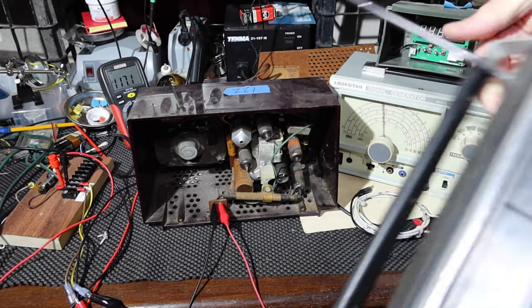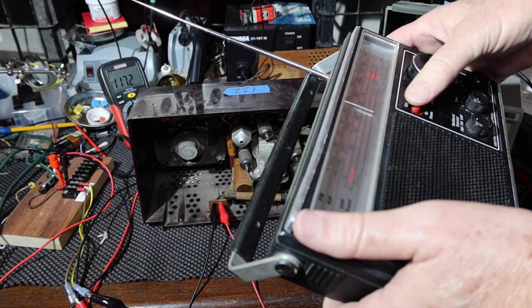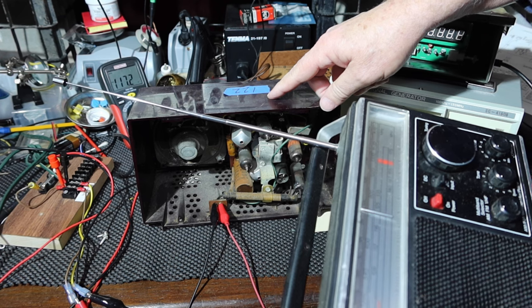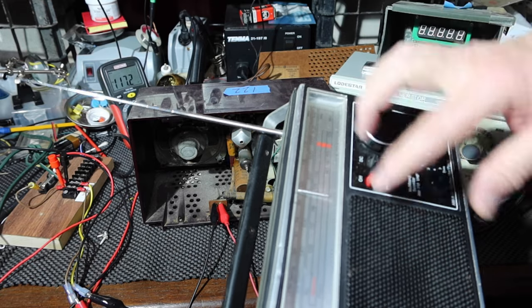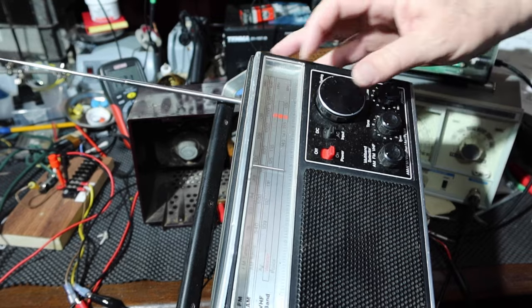So now I've shown this on another video. Got an old AM radio I got years ago, and you turn this on and tune it to a station, and then tune this such that you're changing the frequency that the oscillator's on, and look to see if you get any interference on this. Okay, so you got this turned down. We'll be listening to this, even though you hear the hum from that radio. So you hear this one.